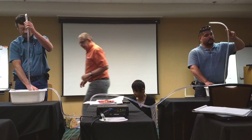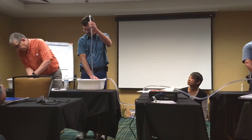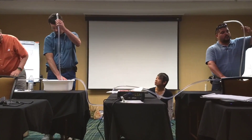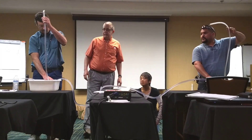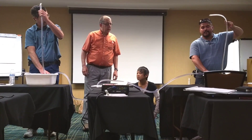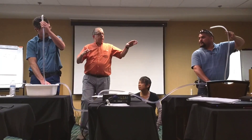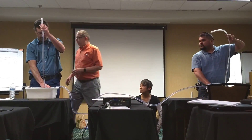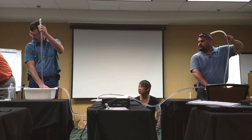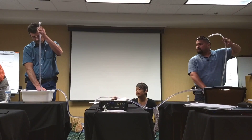Now I'm going to open this valve. Alright, and you can see this one drops a little and this one drops a lot. Friction loss. So how could I increase the difference - that is, have a greater difference between that one and that one? I could open up this a little bit more, which I will. Watch this one drop even more. That's just indicating that there's more friction loss.